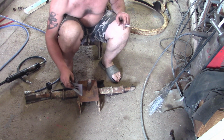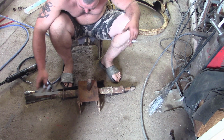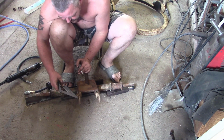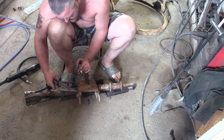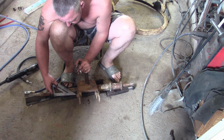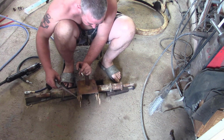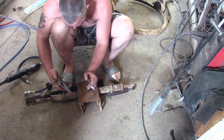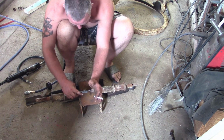Okay, so this is the front axle for the mixer. A few things I've noticed. It's got the attachment point for the handle. This has been made by someone, so I think originally it attached where these bolts are, but this has sort of been snot welded on and bolted, these two, which you could probably do a tidying up. This pivot post here is quite badly bent and worn.